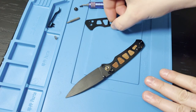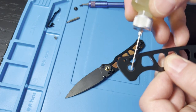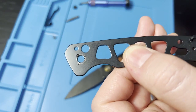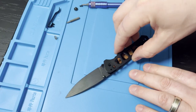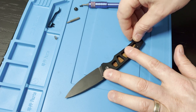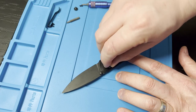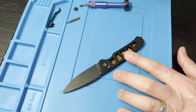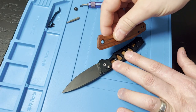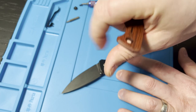The last thing I recommend is to go ahead and reinstall. I almost forgot — do your triangle here on the track as well, and you can really see just how lightly I'm applying it. I recommend putting the skeletonized liner in place. Make sure everything falls in nicely — just jiggle it lightly until it falls in. Do not muscle it, do not force it. It will go into place just fine. Then grab the spring and put it down into the button. Make sure it's sitting flush, then work it down into place. Grab your pivot bolt and get it tight down until there's no more resistance when tightened freehand.